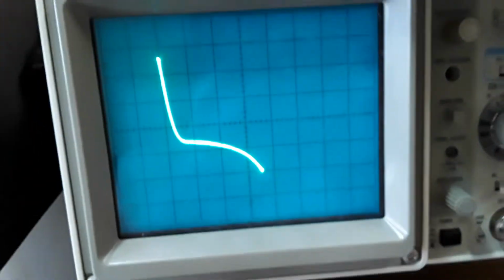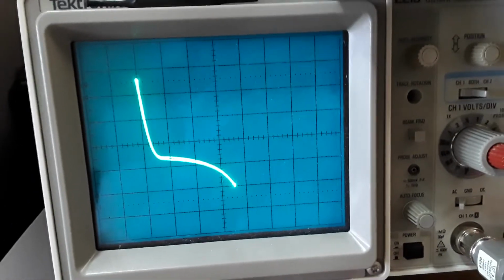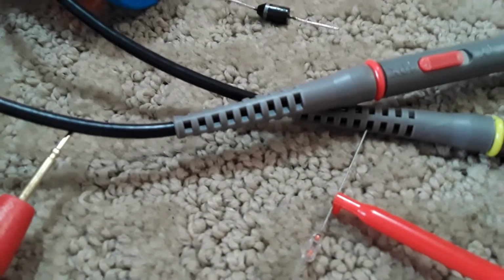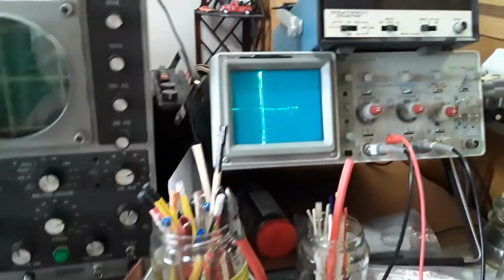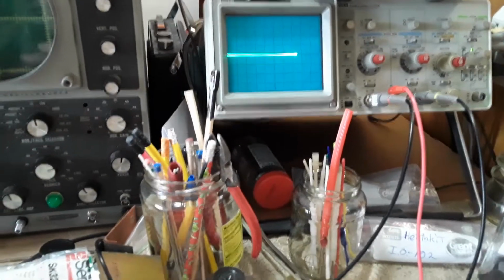And I get that. And I have some Zener diodes from building transistor projects a long time ago, and I didn't take any out yet. So these diodes kind of do that. This is, I think, just a regular radio diode, I'll call it, 914, or the 1N60 or something. That is showing me open circuit. No deflection. This is short circuit, open circuit. So this diode is no good.